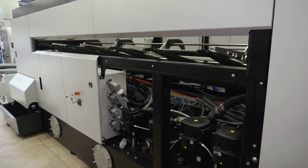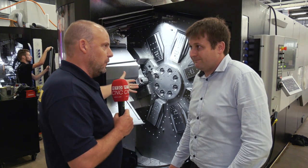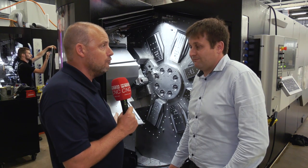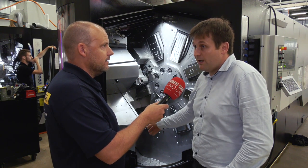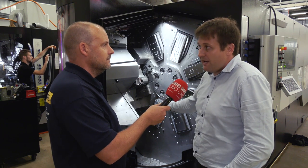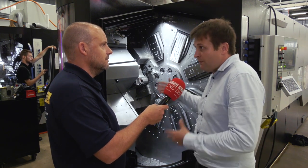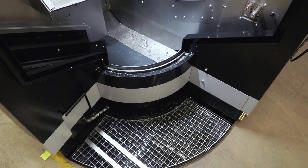You put all your bars in the back — it is quite a big machine — however, with eight spindles it could replace maybe three, four, or even five machines that would take up far more room. Yes, for sure — you win quite a lot of square meters with this machine. It could easily replace five machines, sometimes eight, and it's not that big when you consider all the peripherals are integrated into it, so it's a good deal per square meter.